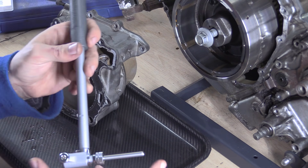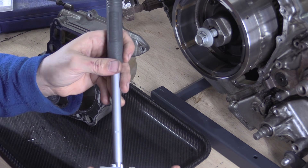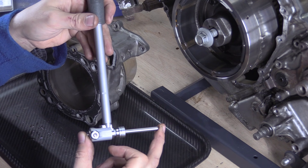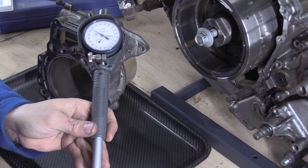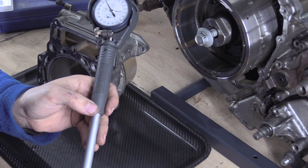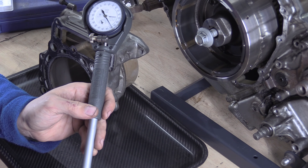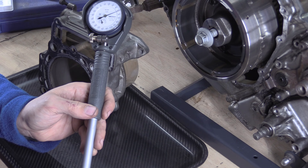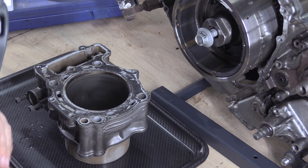Because we've set this distance here with the micrometer at 98.5, this should squish this down and we should get a bigger reading. So if we've set this at 98.5, it should read about 7.5 on the gauge. It's not the most complicated thing in the world, but you're basically measuring a reduction, not a size — you get a number you then have to subtract.